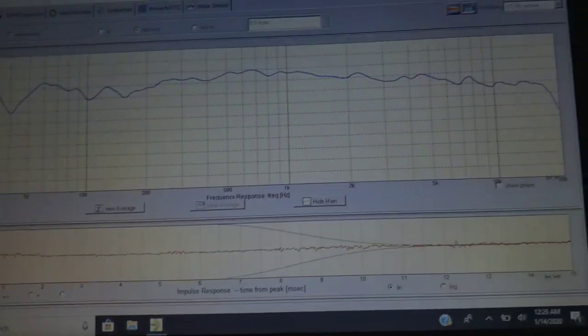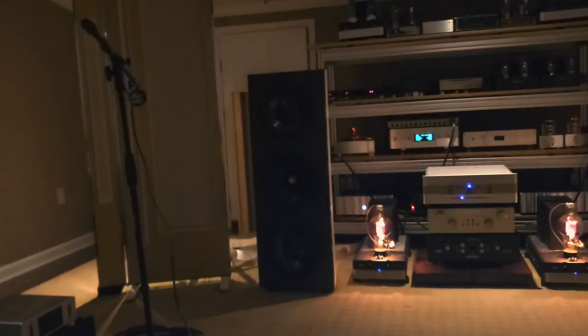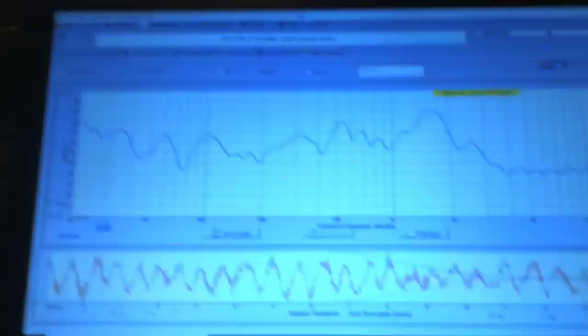What I want to do now is check the left side. At the same time, look what I got — right where I need to set my microphone stand I've got a cable snake pile. Let's get this stuff out of the way and put the mic in here — that's about the right distance. We're doing rough general stuff right now, just a rough quickie, because we can really put the pedal to the metal later. I'm not going to worry about reflections; I just want to see if that notch is going to be there because I have not reversed this tweeter yet. Left channel, short sine sweep.